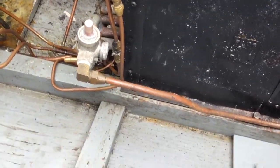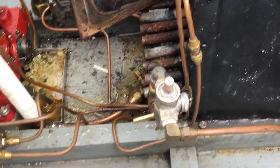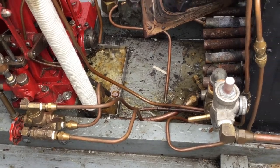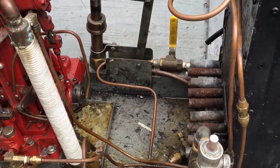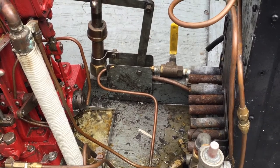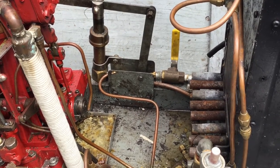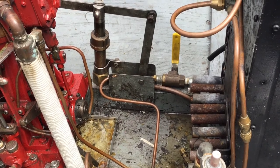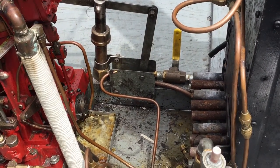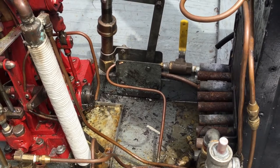Right now there's nothing draining in there — you can see how it's wet. I put this shield in to keep the pilot from blowing out. That's the way the original builder built it — I just left it as is. Now there's no actual water level gauge on this boiler. The only way you know if you're too high is when you open the drain valves and find water coming out. That's the problem when you're pumping in. You have to watch. When you're firing up and seeing saturated steam, that's fine, but you could be low. I'd hit the hand pump a few more times as soon as the gauge gets to about 80 or 100. It's all by feel — there's no water level to read.